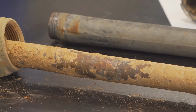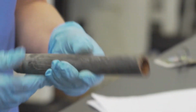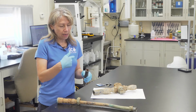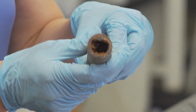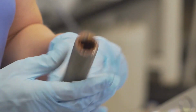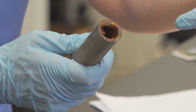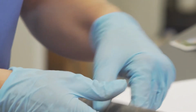The next pipe I'll show is galvanized iron pipe. Galvanized iron pipe isn't installed anymore. With this pipe, water interacts with the iron on the inside, and it rusts on the inside. So they tend to have problems with low pressure because they get clogged. You can see that we have some what we call tuberculation buildup on the inside. So they give lower pressure inside homes.